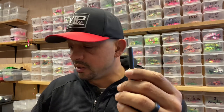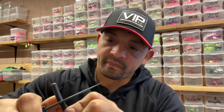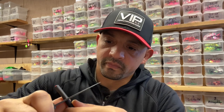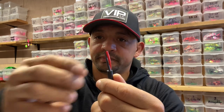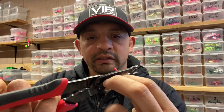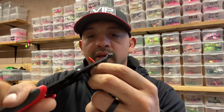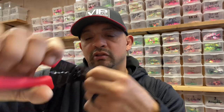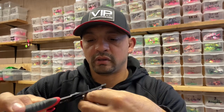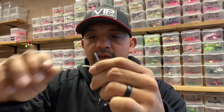Let's get this guy prepped. I'm going to do it old school — take my knife to it and go about two inches down, make a cut, pull that off, and expose my hot and my ground. Then take these fancy wire strippers — that's a 12 to 14 gauge — strip about an inch worth, give it a little twist, and pop that off. Twist those tight.